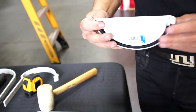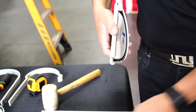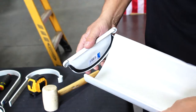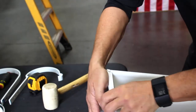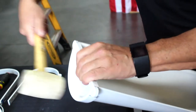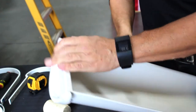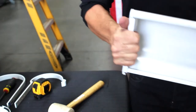The universal end caps have a similar type of EPDM rubber that actually grips really hard on the gutter. They have four flanges and a much sturdier type of EPDM than the gutter connectors. You can either just slap it on with your hands, or as Jan is showing, just use a rubber mallet. Once it's on, we can guarantee it does not leak and it's really hard to come off.